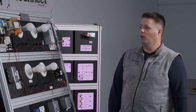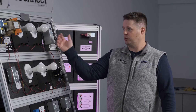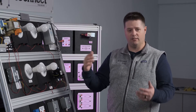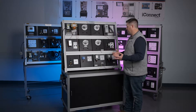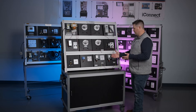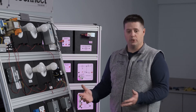In this lesson, we're going to wire a combination of control circuits and load circuits. The loads are going to be four light bulbs, two sets wired in parallel. We'll demonstrate this by bugging one of the light bulbs and seeing that only two turn off instead of all four, because they're wired in parallel. We're also going to use a control circuit to control the contactor coil in the event of a low or high pressure scenario, and we can use the bug switches to create a troubleshooting lesson.